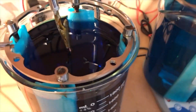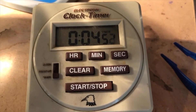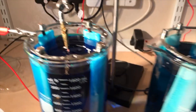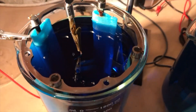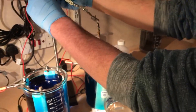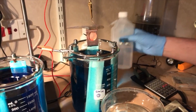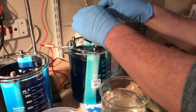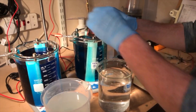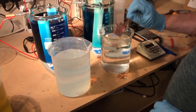Then put it in as quickly as possible into the copper strike — five minutes and leave it in for five minutes. When it's finished, take it out and put it in the other tank. Rinse it in between. The other tank is the copper electroforming solution — it's this one. Take it out after 10 minutes; we put it in there to form a little bit of copper.